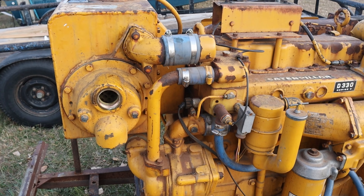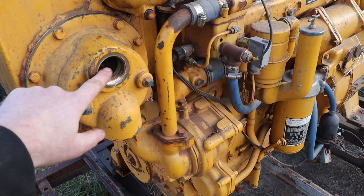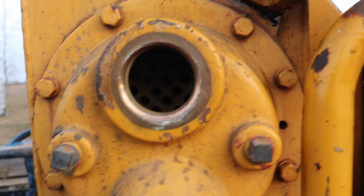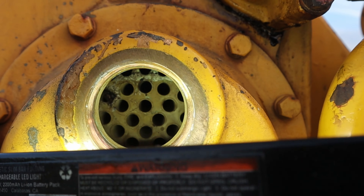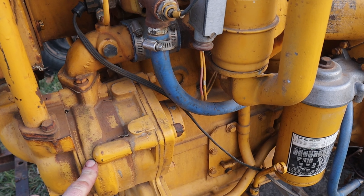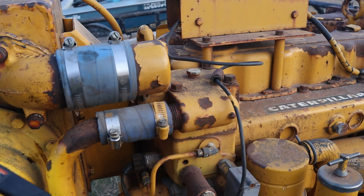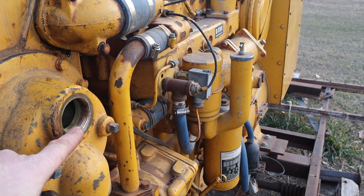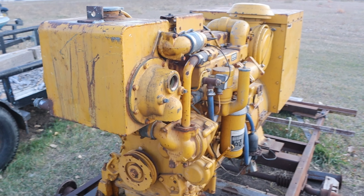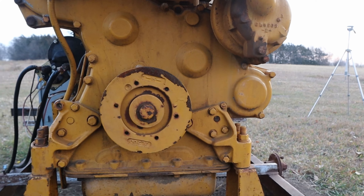There's the serial number: 4B1170. What's weird about this unit is that it does not have your typical cooling system. I think they had this plumbed into city water or something like that. Looking inside here — you see that? — it's kind of like a condenser type deal. So here's the actual water pump, and it pumps water through the engine and comes back out here. Then you got these two ports, which I think is like a heat exchange type situation. If we do happen to get it running, what we can do is maybe temporarily put a garden hose in there. There's no fan on it, no radiator.